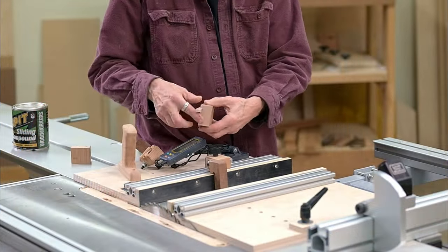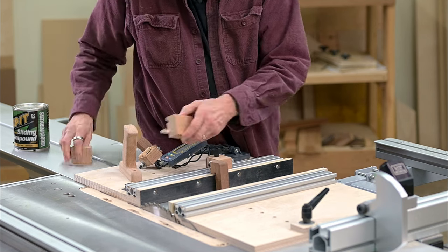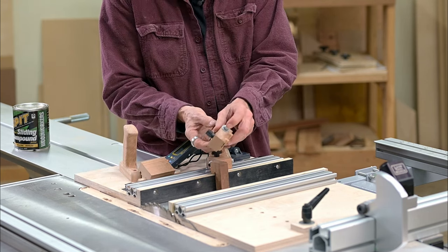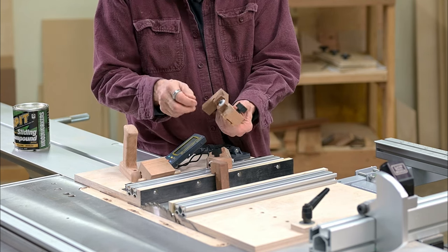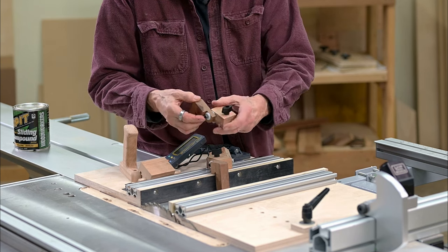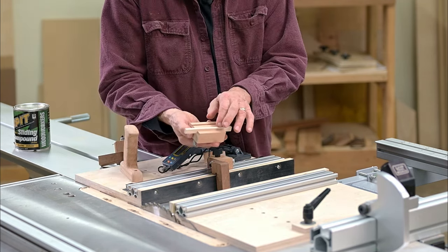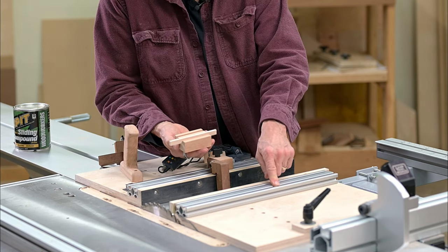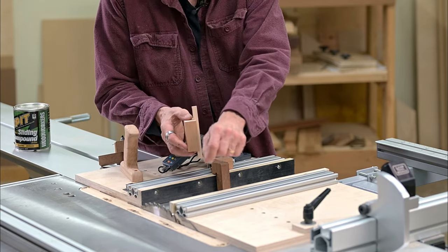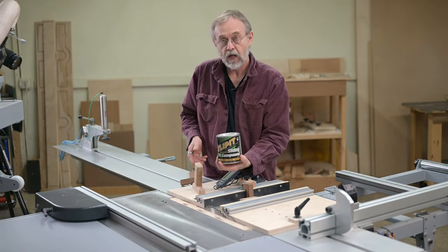To start, I made a long section of this with two grooves that fit the runners, then cut them to length and drilled a hole. That hole is for a quarter-inch bolt and it's tight fitting — I had to pound it in there. There's a lock nut on this side with a flip and two nylon washers. Tighten it up and this is pretty sturdy — it doesn't bend. When I glued these in, they were a little tight on purpose. I came back slowly with a scraper and a mini sanding block and worked it until it just barely started moving. Then I used this stuff — you could use wax, or this stuff is called Slip It Sliding Compound. Works great.